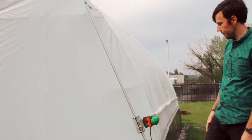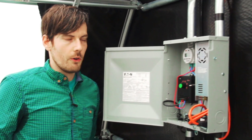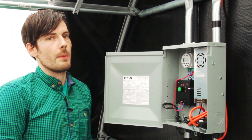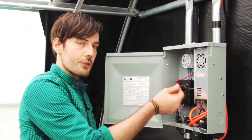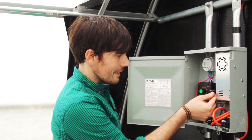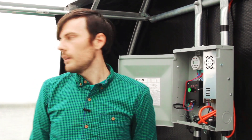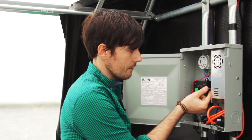So let's go take a look at how this works on the inside. Now we're going to go over a basic overview of what this auto roll-up side panel is all about. We have our converter here, our temperature range control, and our programmable timer. I've got mine set to 60 degrees right now. So basically, if it's below 60 degrees, the tarps will be down to keep the greenhouse plants warm. And when it peaks 60, the tarps are going to roll up, and I don't have to be here manually doing it, which is super awesome.